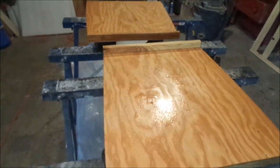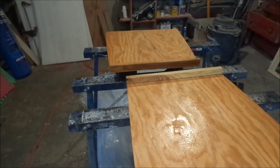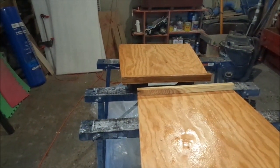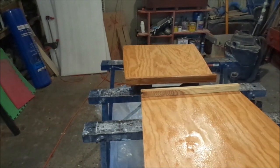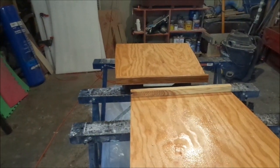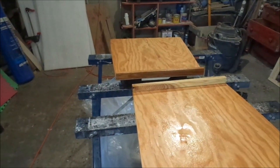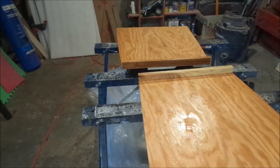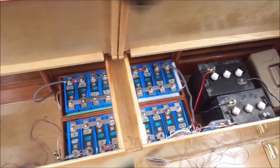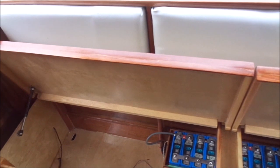These are two new battery shelves I have made, and I am moving the batteries to the front part of the boat — not right up in the bow section, but just past the balance point. I found there was too much weight in the back and it was driving the stern down. Currently I have my battery banks under the very back seat.